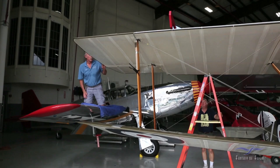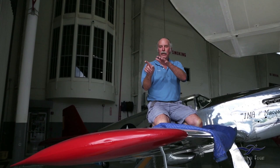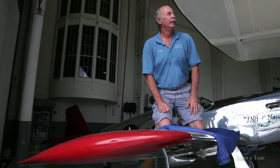All right, this one's washed in as well. The engine spins this way, so the airplane is going to want to go this way. So if we had a little bit of down over here, it wouldn't hurt, because it would compensate for the torque. There's very little. There's this story about a Sopwith Camel would turn on a dime one way, and it wouldn't hardly turn the other way. Total bullshit. You can't even tell.